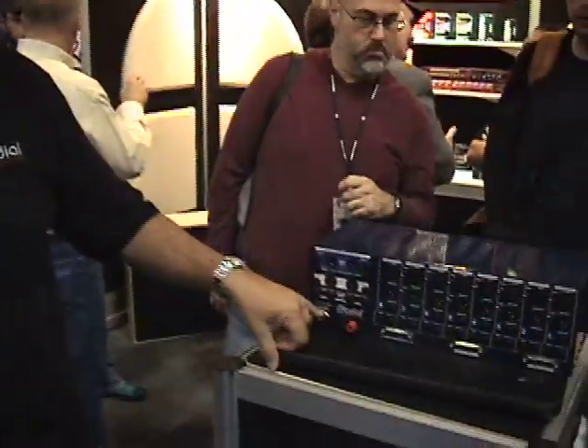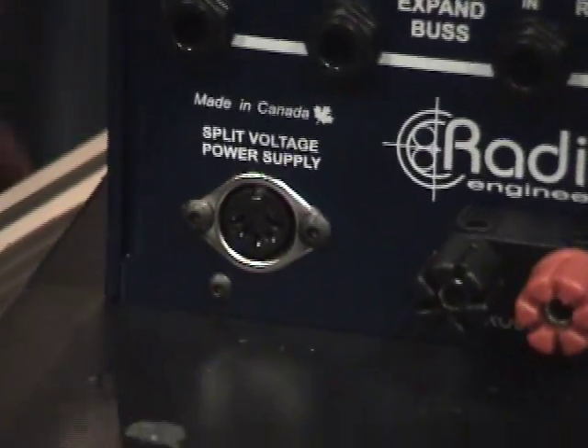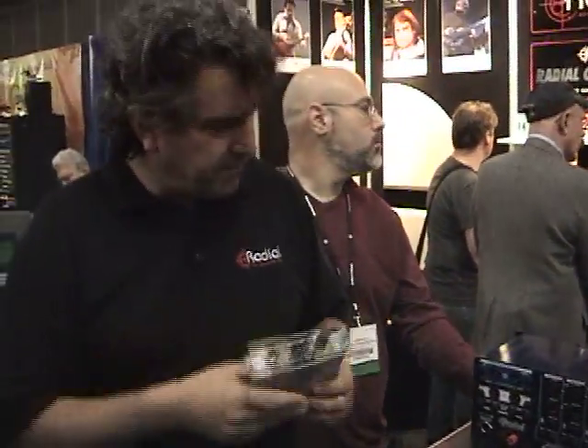The other thing we've done is we've used an external digital power supply to feed the box, because we didn't want to have noise inside the box — space is also a consideration. As you bring things closer together, you get more noise, so by putting it in an external supply, we solve the problem. It also gives us other advantages: we can spec our own power supply, and instead of 5 milliamps phantom power, we've got 15. Instead of 110 milliamps on the logic, we've got 150. By having more current available, it just makes everything run better. And it's all auto-tracking, so if one device goes down, the others are completely separate.